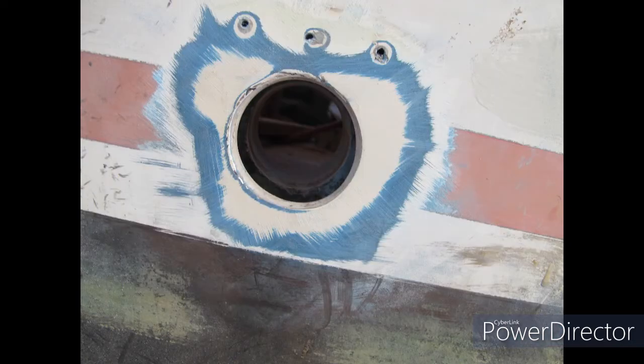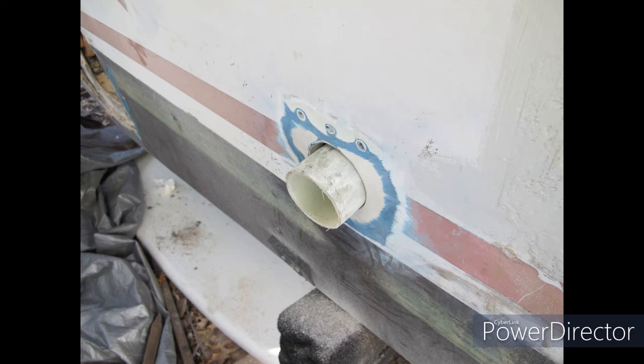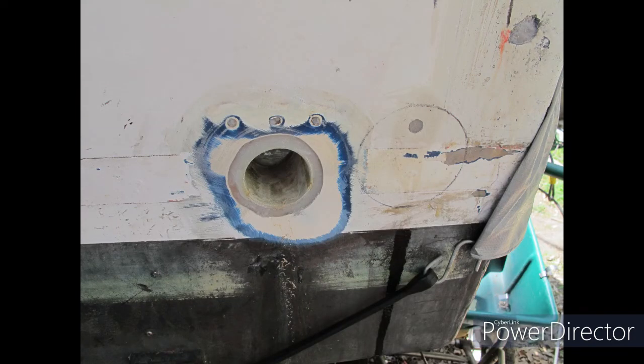Here you can see there's a little bit of a lip at the top of the transom — I had to fill that in. I had to do a lot of miscellaneous work. Those are the scuppers — I had to redo the scuppers. Made my own tube there, epoxied that in, fiberglassed all that in, so the water that gets inside the hull can get outside.